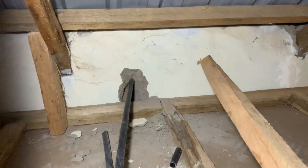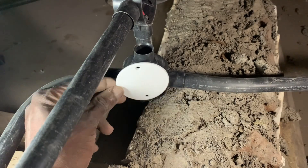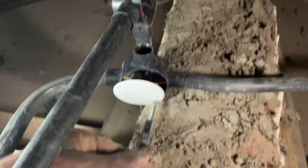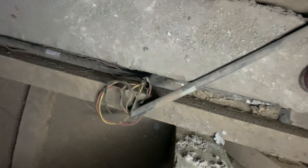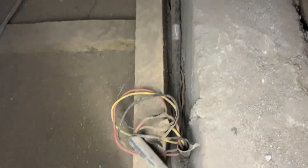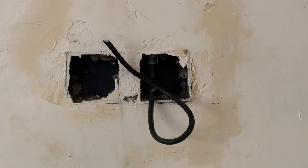When it comes to piping, it is yet another important thing to consider because heaters draw a lot of current and they may overheat the cables. Since we have a better choice of cables they will not overheat, but another aspect to consider is rodents. If you have cables just bare up there in the ceiling then they are exposed to rodents which will eat up the insulation, exposing the wires, which might short circuit and finally either burn the home or cause serious electrical problems.